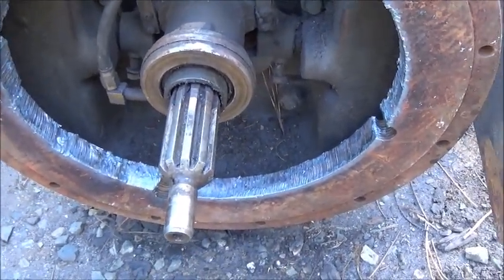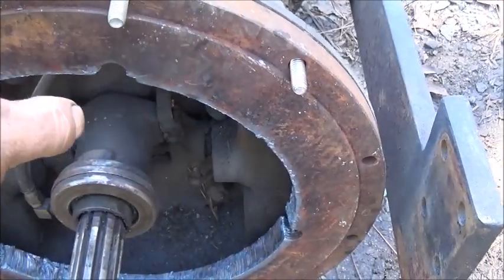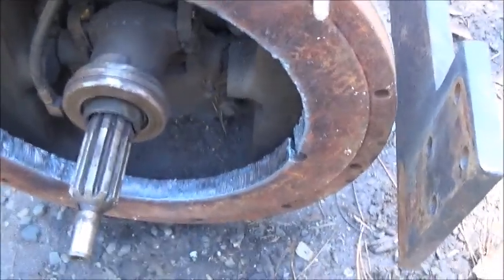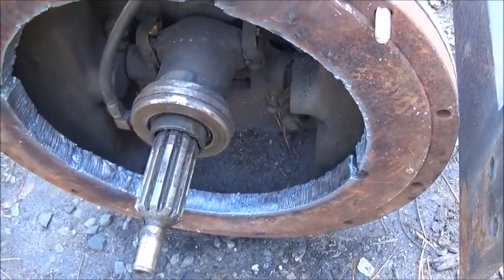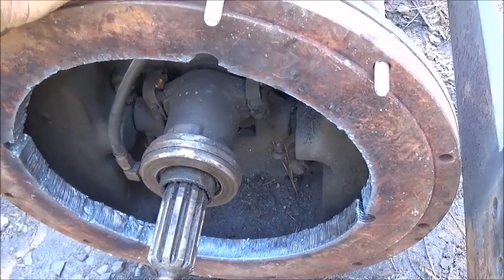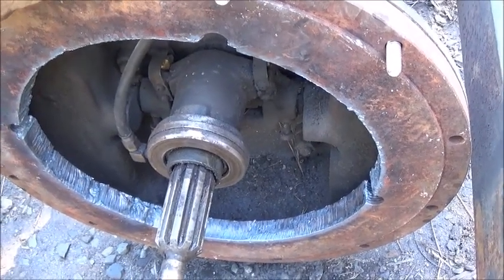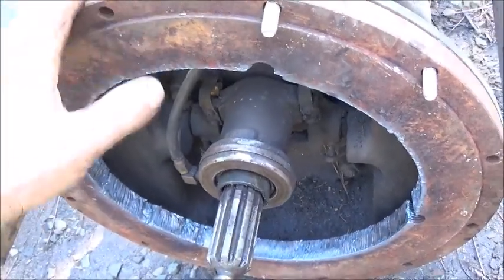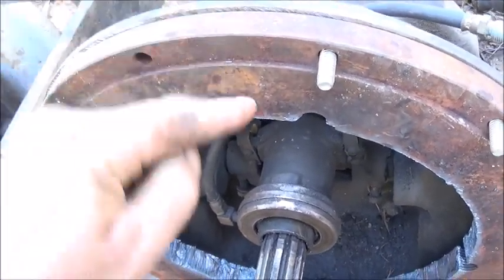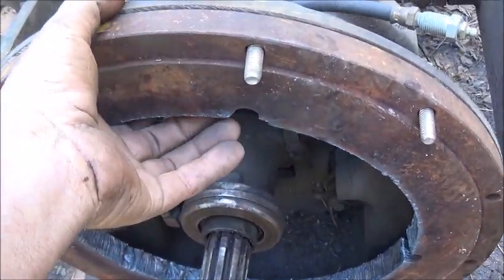This clears the first plate real good. This has got the alignment here but it didn't have it on the other side. I was going to machine it with my indexing head but it wasn't solid enough — there was so much chatter and movement that I ended up grinding the lip off of the bell housing. It was about a quarter-inch wide lip, and now this fits flat.